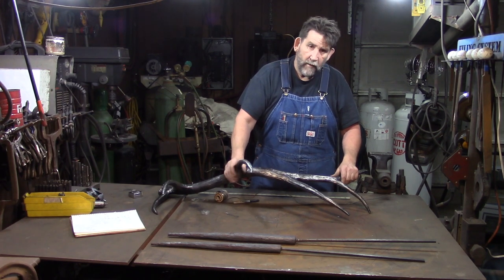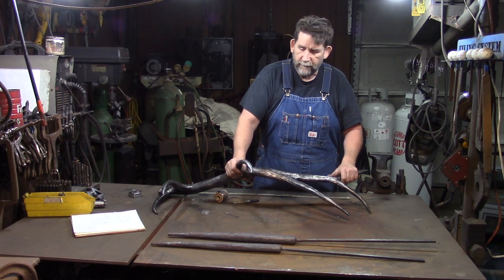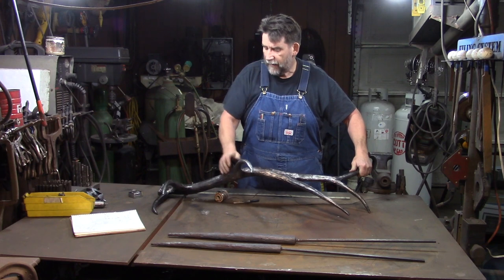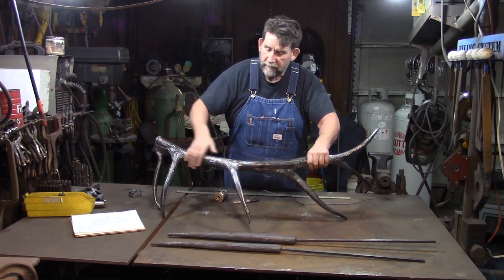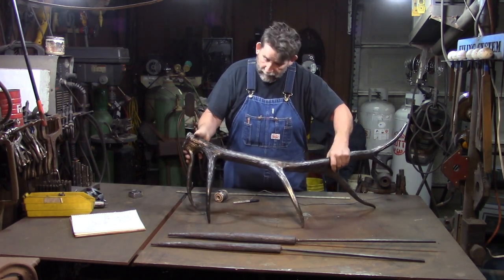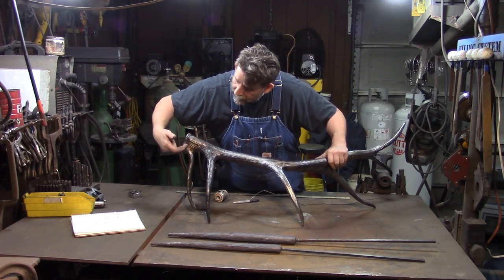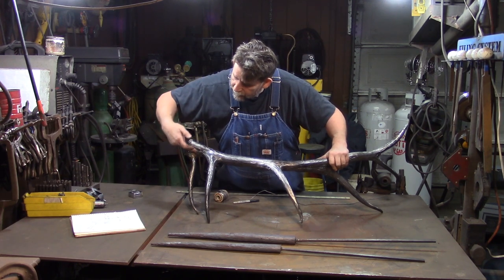Okay? Three passes normally does it. Every once in a while you might have to just touch up with a fourth, but three passes normally does it. When you get done with the third pass, all this should be smooth and blended in, okay? Now on this one down here, if you look at that, that actually came down and around here, so I had to put a pretty sharp bend here and then fill that in.